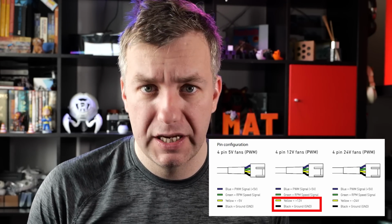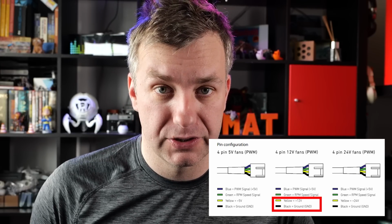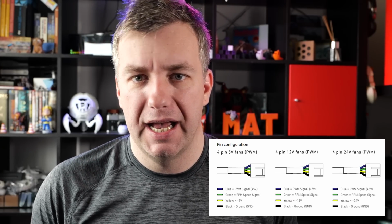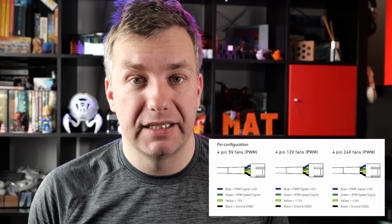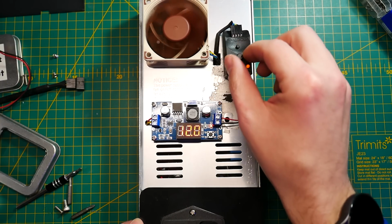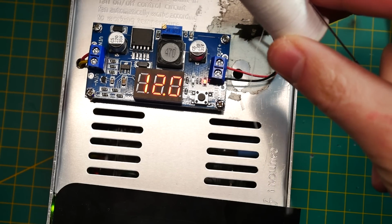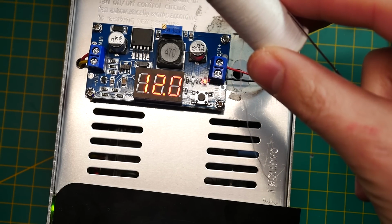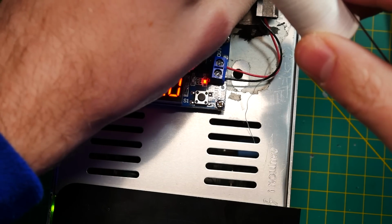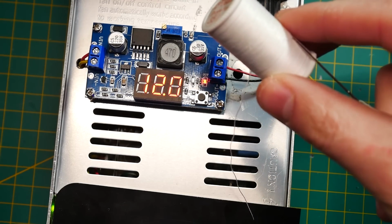To connect your Noctua fans, you'll have to find your power pins. As I have PWM options of the fans, I have 4 pin connectors. Now only 2 are being used, and in this case I'm using the NAFC1 PWM signal controller so I could reduce the fan speed and control the loudness and flow of the air inside the PSU. But if you're interested, all you have to do is just supply the power to the yellow and black. Black being negative and yellow being positive.